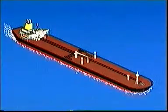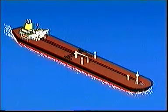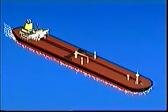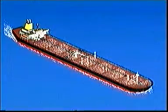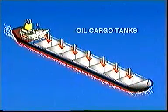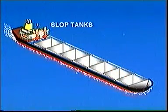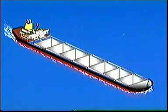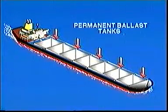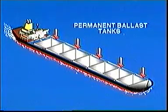The vessel is in a light ballast condition and trimmed heavily by the stern. Should the weather turn worse, it may become necessary to take on board more ballast water. Our vessel has 7 cargo tanks and 2 slop tanks. Port and starboard slop tanks are filled with ballast to almost 6 meters ullage. The vessel carries ballast in 5 segregated ballast tanks. There is no double bottom.